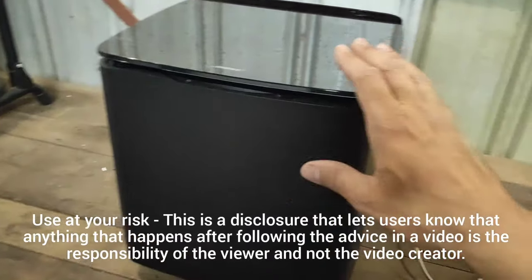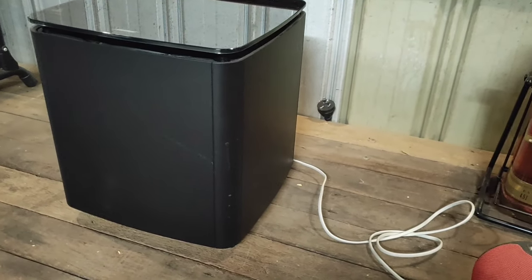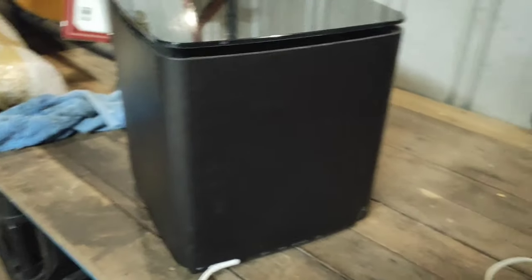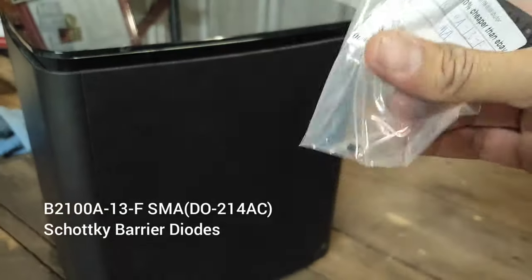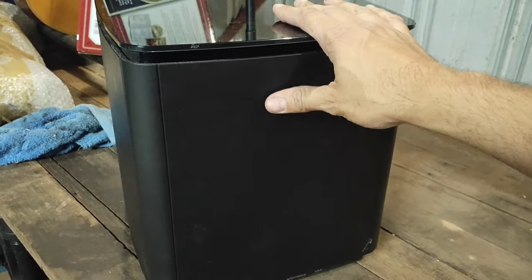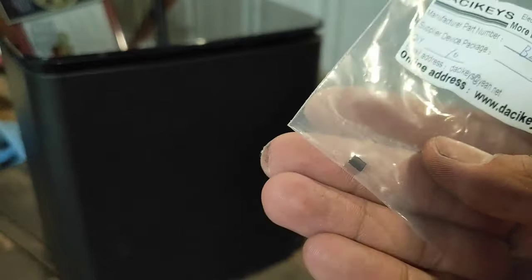In this video I'm going to show you how to fix a Bose Acoustimass subwoofer that has failed to power up. The status light is off but the power is switched on. This just stopped working overnight — worked fine one day and then the next it stopped. After research, it turns out one of these tiny little chips has gone faulty. A lot of these, after about two years of use, will have this fault, and it's just a simple matter of replacing this MOSFET chip.